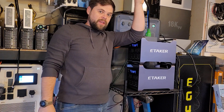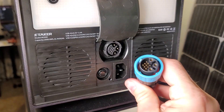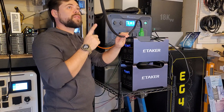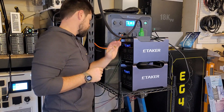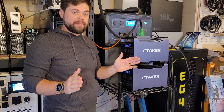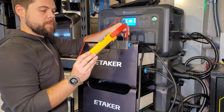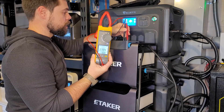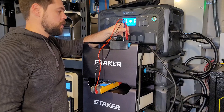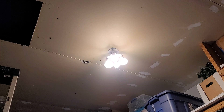To get it operational, I turn on the AC power on both units and the indicator light kicks on. I plugged in the 240-volt connection and it's live — but I don't believe that was caught on camera. I had not had this issue before when testing these units, but it did not run power to my whole house. My lights started popping and making crackling noises. I'm getting 240 volts at 60 hertz, but I'm not sure what's causing the problem. I'm going to try one more time.